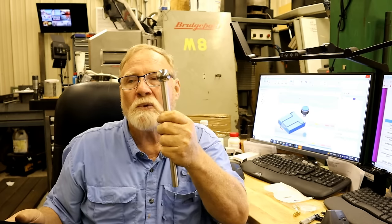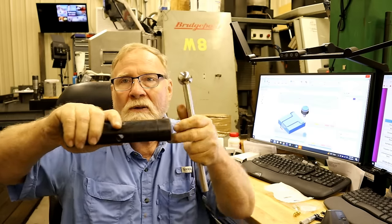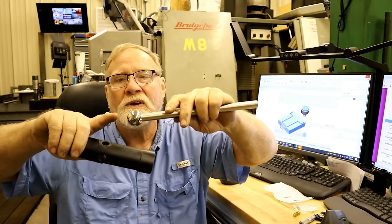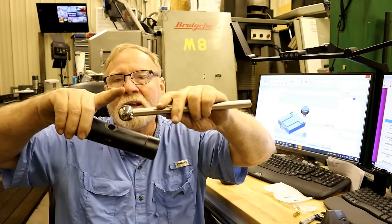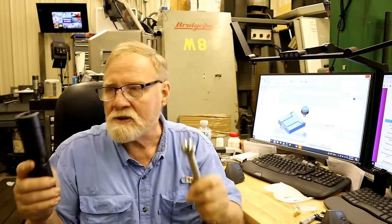This was the one that I wanted to be really super precision. This one has two points that'll keep it aligned as it's going down, whereas this only has this one point. But if you put it into a V, inverted V rail, it'll have a point here and a point here. So this isn't as critical as this.